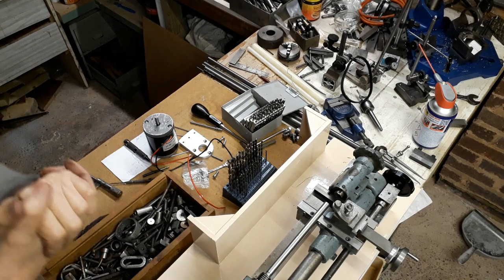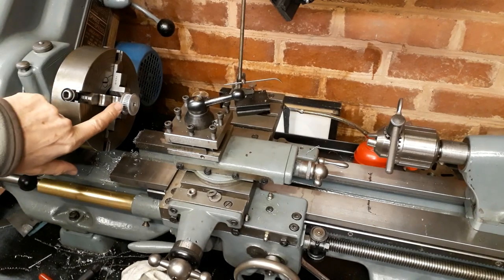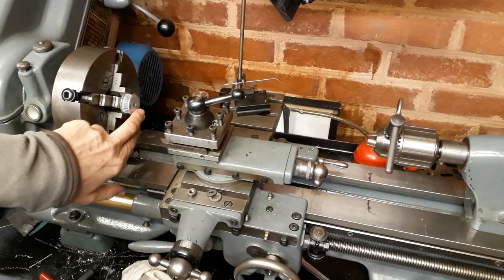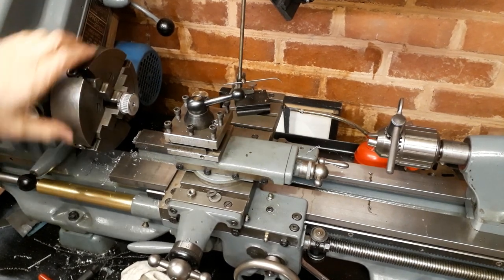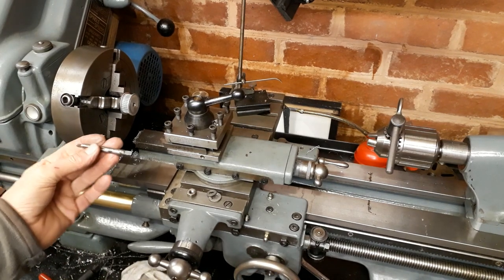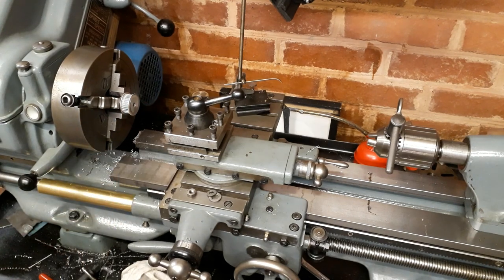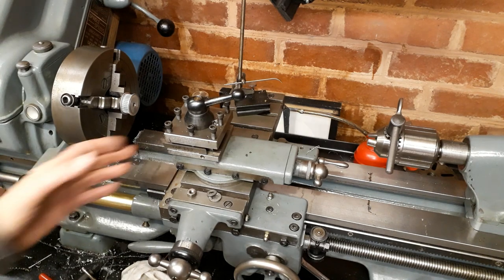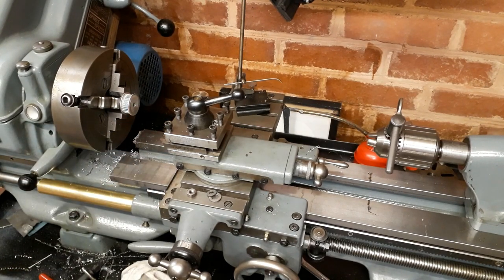Let's go over to the lathe and have a look at the pulley which is set up ready for machining. I've clocked up the pulley — not on the flange because that's not true — I've actually clocked up on the pulley diameter, and that's nice and true. But I hit a bit of a snag because my smallest boring tool is just not adequate for this hole. It's currently a 6mm hole and I need to open it up to 8mm, so I need to make a new boring tool. I'm going to make a new tool which enables me to tackle smaller holes like this, so I'll do that off camera and hopefully we can use that next video.